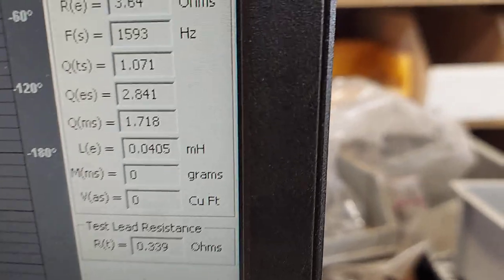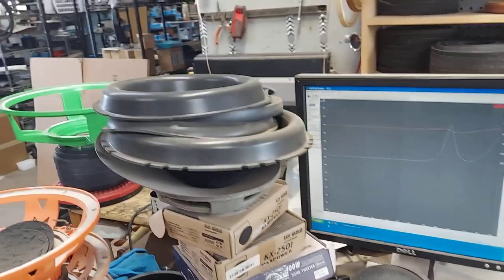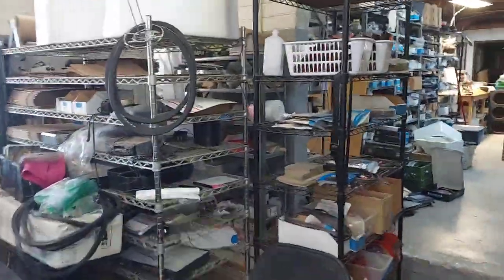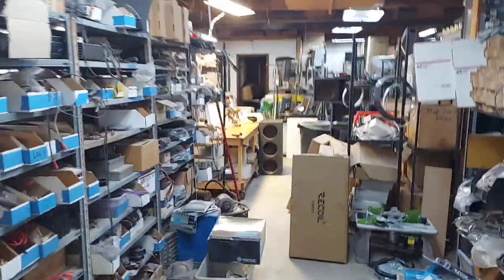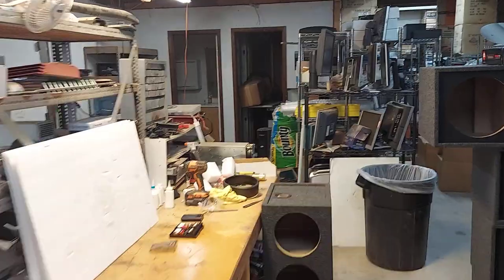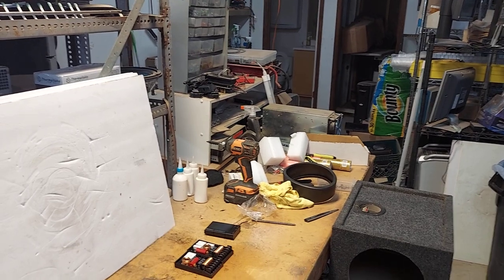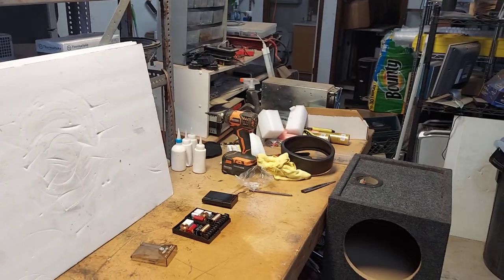On the tweeter we got looks like about 1600 Hz, which is fine. It should cross up at about 3.5 kHz or higher. I'd have to figure out the components on the crossover to see what they did, but typically for mids and tweeters you want to go one octave above the FS, if not a little higher, just so you have a good balance of power handling. Because the downfall for mids and tweeters is they're super sensitive but people overpower them.